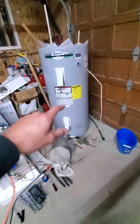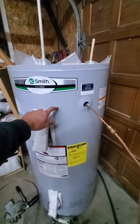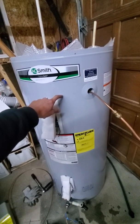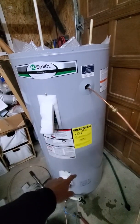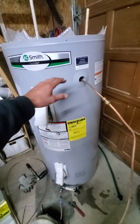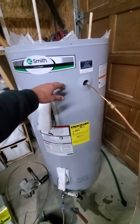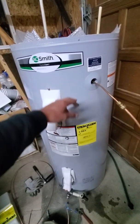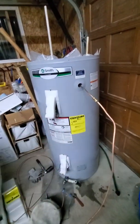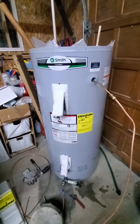Hot water pulls from around the top. I'm actually going to snip the pickup tube and let it pull from the top. I looked at dissections of heat pump water heaters and that's what they do — the water pickup tube is right at the top, because they don't have an element on the bottom making it as hot as a normal water heater. The water gradually drops in temperature because the heat pump heats with a coil, so I'll do the same thing to get a more gradual use of hot water.